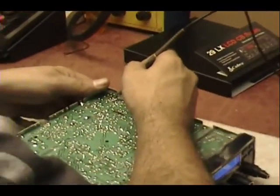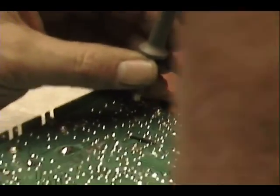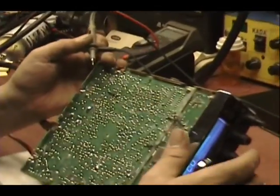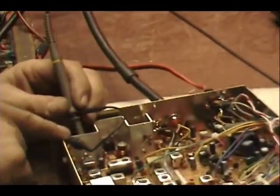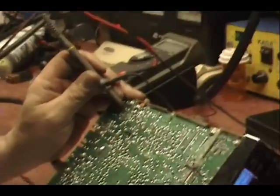I'm looking at the driver transistor on the O-scope right here — nothing. Just audio there, no RF energy. I checked the input and output of the driver transistor and got nothing on the O-scope but some audio.